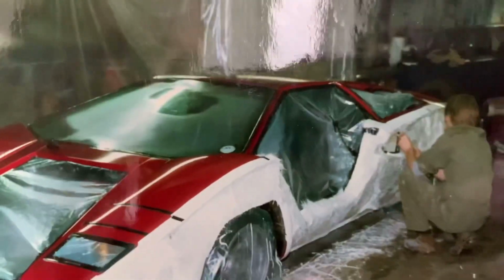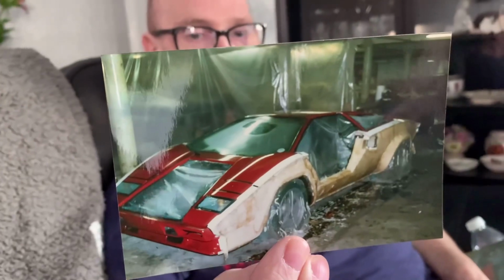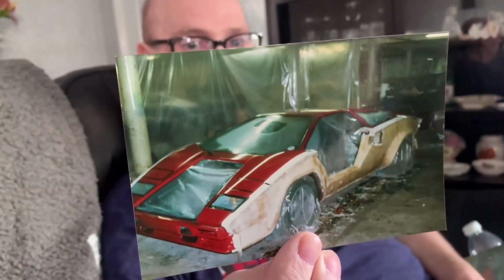So this picture, there's 3 pictures of the side here. This picture is just after us putting the gel coat on. And as you can just work out, he's putting fiberglass over the top of the gel coat. And what we did was we built a flange, along there and along there. So we gelled up underneath the flange. That's the gel part of it. That's the actual fiberglass going on top of the gel coat. You can see the resin going on it now, isn't it?